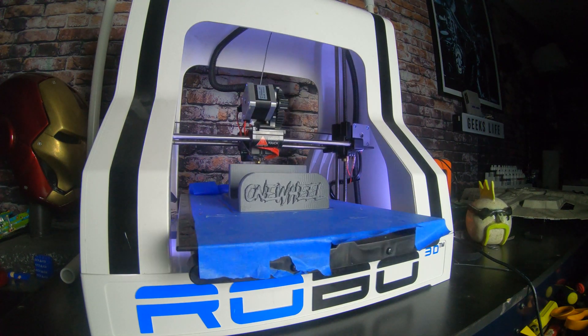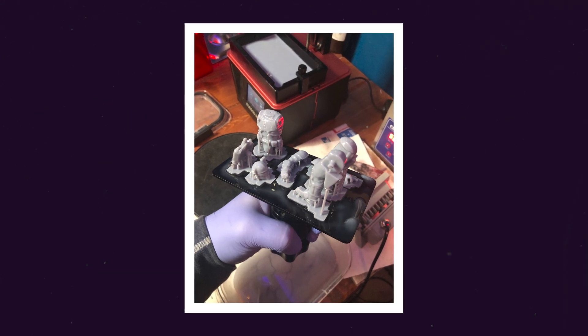This is not the same as an FDM printer. An FDM printer uses a spool of plastic — this right here is a roll of PLA plastic. It goes into the printer, melts in a hot nozzle, and squirts itself out into a finished product. DLP and LCD printers are a little different. This is resin — it's liquid-based 3D printing. An LCD printer exposes the resin with UV light, which cures it layer by layer. Unlike FDM where the print starts at the bottom, resin prints upside down — it comes up out of the liquid. It seems like magic every single time.